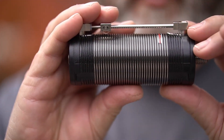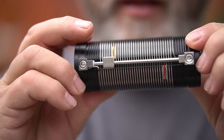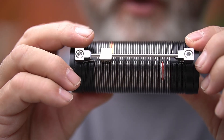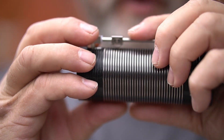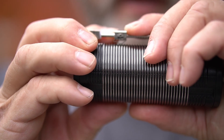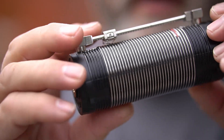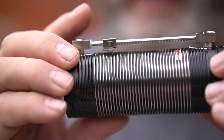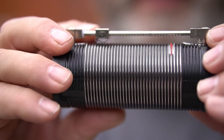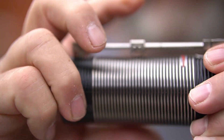Let me show you what I was actually doing - I didn't really show you the coil and how you adjust it, so let me show that to you now. What we have here is the coil. You have a line here - a red line - and then a white one here. One is 40, one is 20; I believe this one is 20. What I was doing to adjust it, because it's really easy to move more than one click, I put one finger against it and then kind of hold tension and do a click at a time. It's real easy to do multiple clicks. So one of these at each end of the antenna and it works pretty good. I actually like the way this one's made because you can just adjust this thing up and down to get it where you need it.